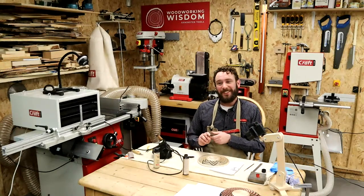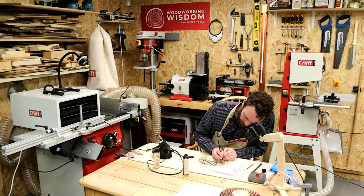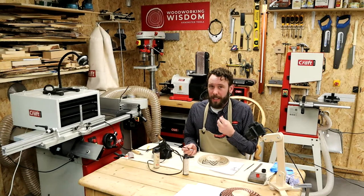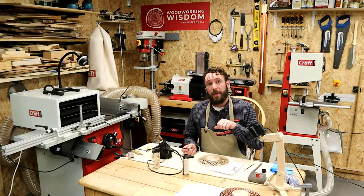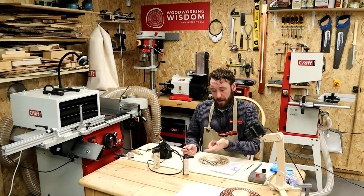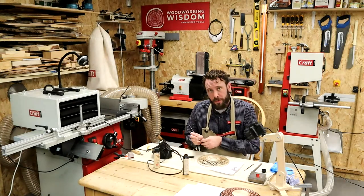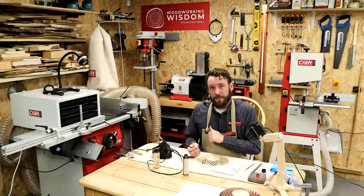Okay, so a couple of people, Graham and Bill, have both suggested, and I think you did it with a couple of your squares while counting up, to mark out the pattern with a pencil or a little marker before you get going so you don't get lost. Yeah, I don't put pencil on because you can see a little shine underneath the spirit stain. For a paint, that would be fine because you're going to cover that. You won't see through it. But I would tend to do it with something very similar to what you're going to use. So if you're going to use a black wood dye or spirit stain, you could use that and just put little dots on things. And then when it comes to filling that color, it will be invisible. But a pencil, you will see through this stuff.